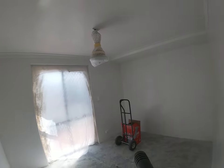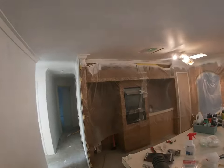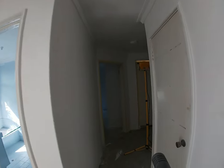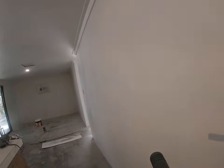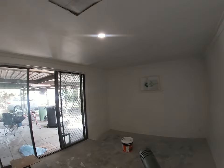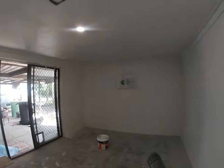So this is the back bedroom with its second coat — might have gone on a bit thick in spots. I've done the lower walls, the bathroom, toilet and two bedrooms, and I'm just going to work my way back to the lounge room. I'll maybe water the paint down a tiny bit — you're allowed 10% — and I'll do those beams again, and then by that time the lower bits of the wall should be ready to go.